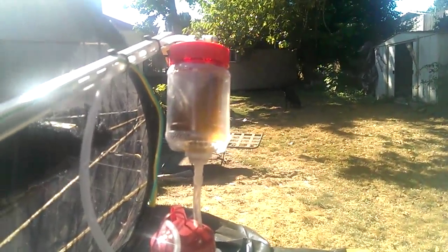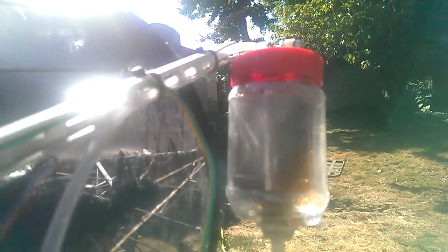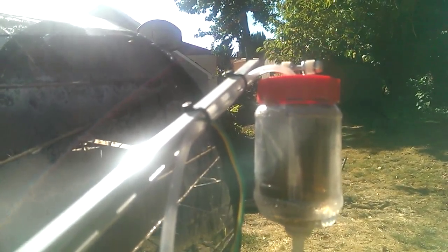I'll just spin this to show you — make some fake wind. It's calculating an average so it takes a minute. Basically the motor is still engaged and the jar within the jar is draining and it will start lifting here in a minute. And there it goes — just lifted. So it lifted and disengaged the electric motor so now the wind can have very low resistance and freely spin the Evapotron.